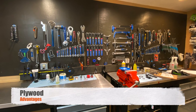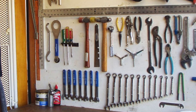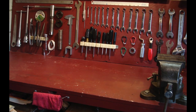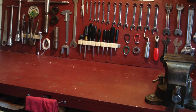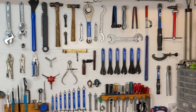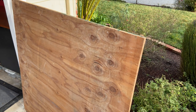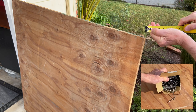That's why most bike shops use plywood for their tool boards. With plywood, you can put tools wherever you wish and only need nails for hangers and simple wooden tool holders you can make yourself. This lets you group tools close together, making them easier to access and allowing even smaller tool boards to hold a full selection of tools. I usually use three-quarter inch plywood and eight-penny finishing nails, which don't rust and have small heads — easy for slipping tools over.